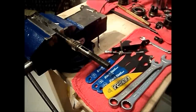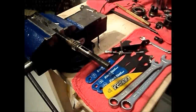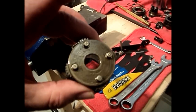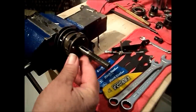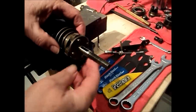We'll begin with the bare axle and build this thing up, describing the functioning along the way. Here we have the Sun gear which, as noted, is affixed to the axle — that is always our fixed or reactionary gear. Here we have the planetary carrier or cage, which meshes with the sun gear. When it rotates about the sun gear, the planetary gears will rotate.